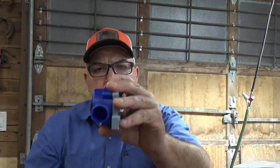So I went to explain to him how the hole in the center of the valve is the restriction in the line that limits the amount of flow rate that's going to pass through the system. And he went to explain to me how he had been trained, and this bigger opening here, or bigger stem, nipple, whatever you want to call it, would actually increase the flow rate. That would really increase flow rate.